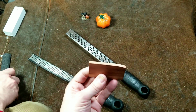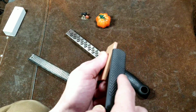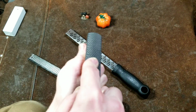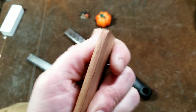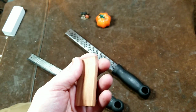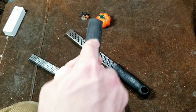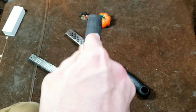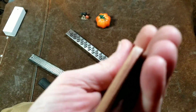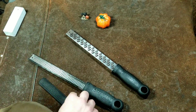I wouldn't say it's the same as a hand plane, because that pulls up one shaving. But if we do something like the coarse side of a bastard file here, which is traditionally what you might use to file wood, we can see that a bastard file actually is much worse. Although bastard files, of course, have fine sections, and when we use the fine section, if we're really doing some real nice smooth woodworking here, the fine section works just about as well. I didn't get that straight.